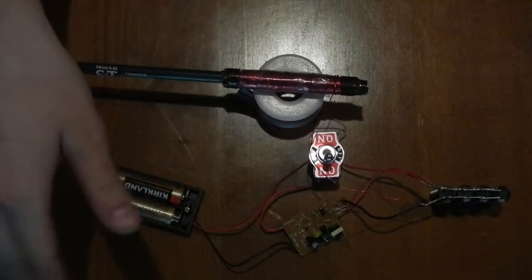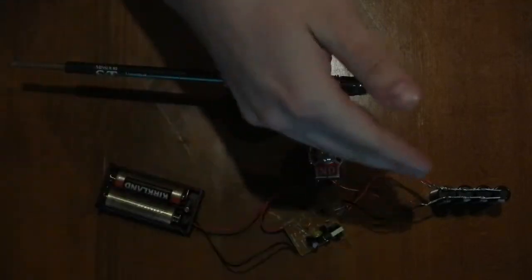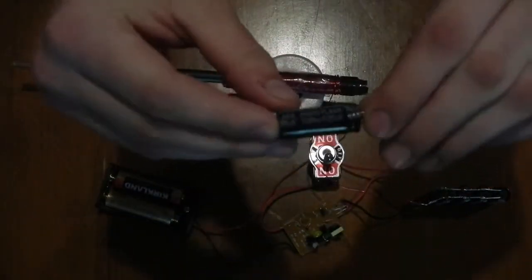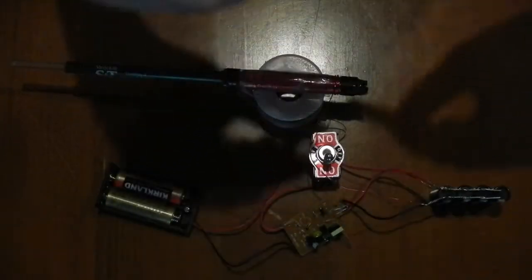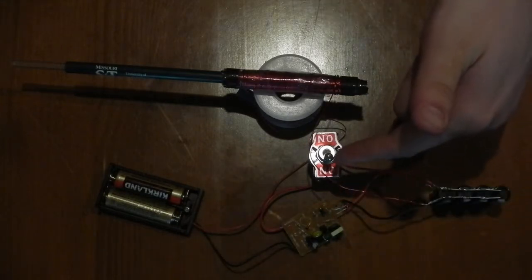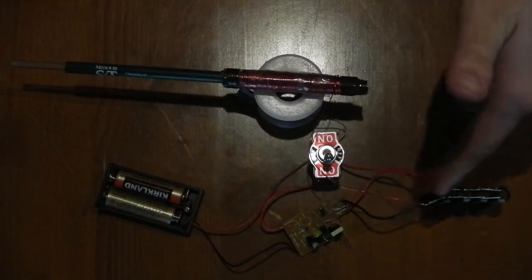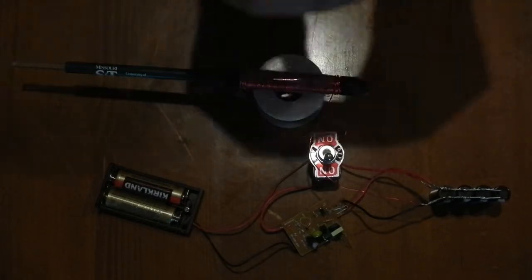Right here are the batteries. When our system's on, the current flows from the batteries to the capacitors and begins charging them. Here's a close-up of one of the capacitors. They're just out of disposable cameras. Once the capacitors are fully charged, you'll see a little light around here start flickering. Then you can turn the system on, and the current that flows from the capacitors to here creates a magnetic field, which will shoot this projectile.